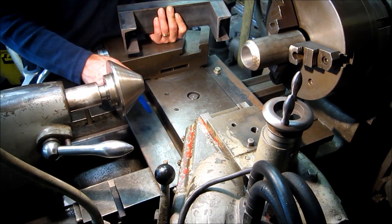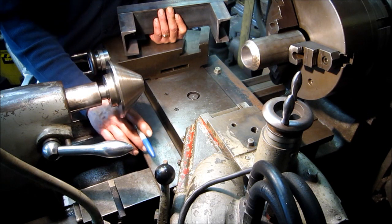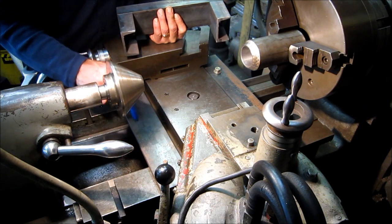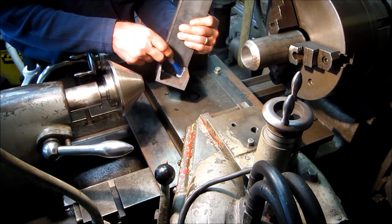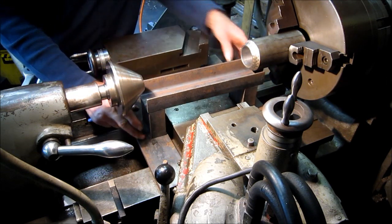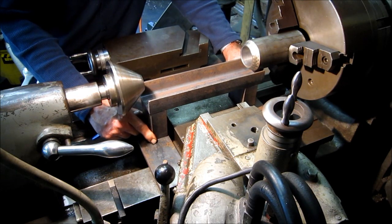We've cut two 1/2 by 3 inch flat bars, drilled holes in the locations we wanted. T-nut slots, you can see here's a slot here, so there's 3 T-nut slots in this engine carriage, and it's typical of the older style engine lathes. So we welded these welds here in the other room there, and now we're going to set this in place here, and we're going to be welding it to the bases here. But we got to set this in place.